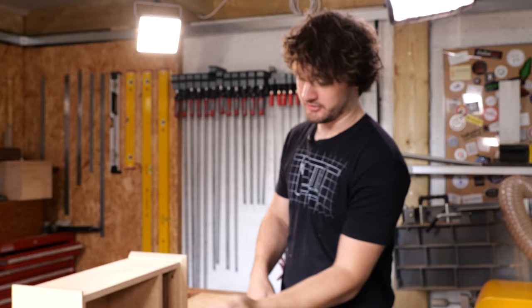To attach these hinges I'm using tiny brass screws. The heads on brass screws shear very easily with too much torque, so be careful. When buying screws, make sure the heads actually recess within the hinge — if they're poking out at all the hinge won't close. You can countersink the hinge a little more if needed since it's brass, but watch out for damaging the knuckle on the inside edge. I'm using a 2mm pilot drill for this — your drill bit should be sized to the screws you intend to use. If unsure, see my video on how to screw wood correctly.